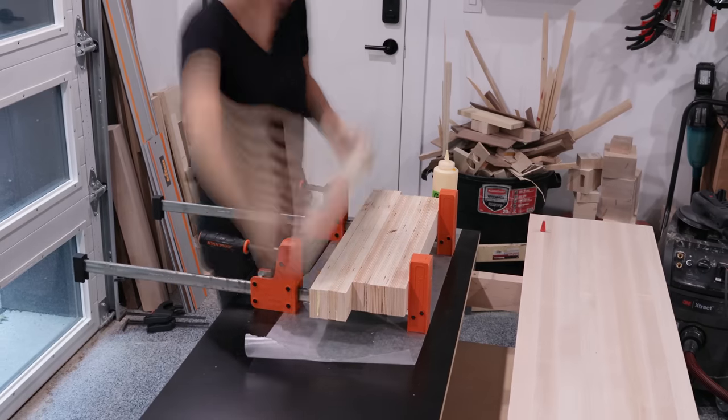Now for the pop-up dogs. These are in line with the vise and are meant to hold a piece and quickly clamp it. Normally there would be a dog in the vise itself, but I'm not ready to drill that hole yet, so I made a quick prototype that goes over the vise so I can quickly clamp against those pop-up dogs. We'll see how I like that, and if I like this clamping situation I'll go ahead and drill for the dog in the actual vise. While I was making the prototype, I found another use for these pop-up dogs — the fit was just a little too tight on something, so I popped them up and pushed against it with my chisel to shave off a little bit of material. Great in a pinch.